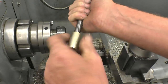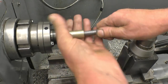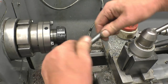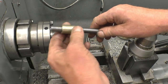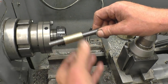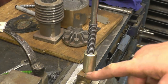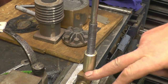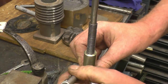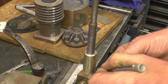It's a nice fit in there — it's not too tight but it certainly isn't wobbly. It's just what you need. Next thing I'll do is solder the nut onto the top. I've used the lead screw to line up the bush with the original nut because I'm going to use the bottom half of the original nut. If I scrape around there that's going to show me where the nut's got to fit down to.